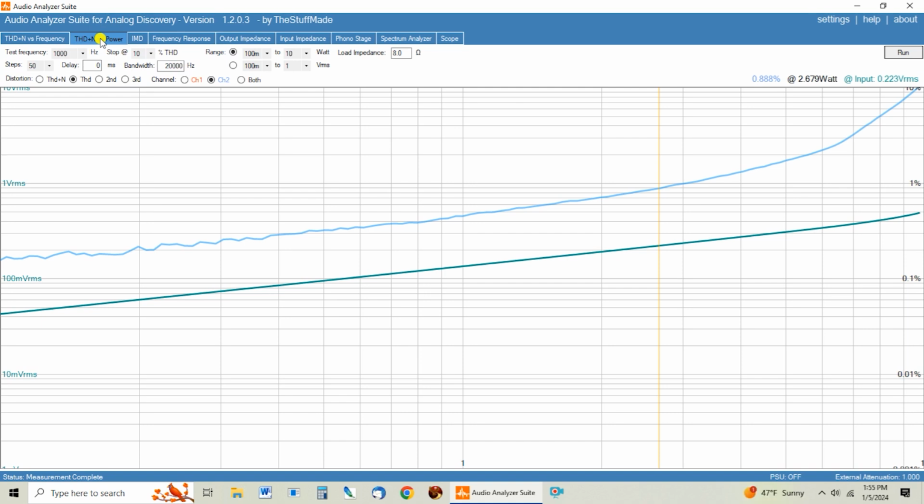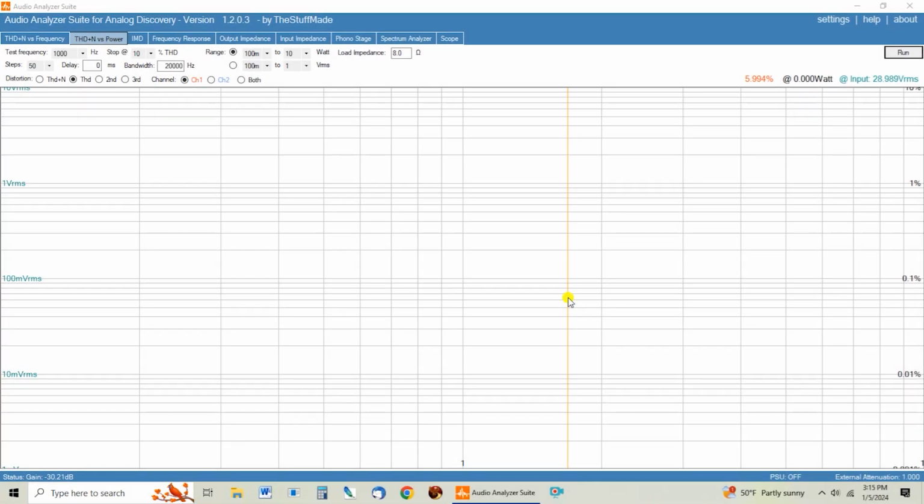the Western Electric 300B tubes and the other front end tubes. Actually, I'm just going to do the Western Electric tube on the output and see what that does for our THD versus power, and see if that cleans this up a little bit. And let's go do that. So we have a pair of real Western Electric 300B tubes in the amp and biased up. These are these $1,500 a pair premium tubes. So let's see how they perform in this amp.